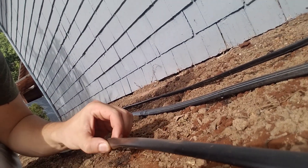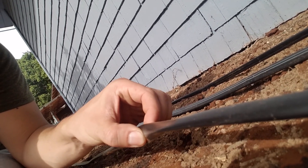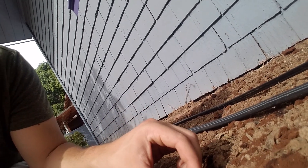Issue three: figure out your water pressure. If you have too much pressure you're going to blow the lines out — drip tapes can only handle about 25 PSI. If you exceed that, they inflate and blow out the line. I didn't deal with this probably because a couple of leaks were relieving pressure. Drip Depot sends out pressure regulators which regulate the line to exactly 25 PSI. If you're DIYing it, make sure you don't blow a line — drip stuff can be a little expensive.